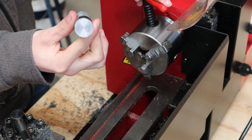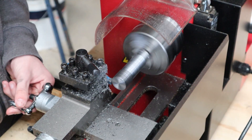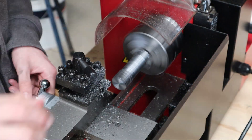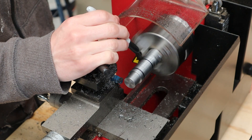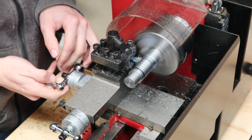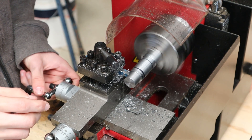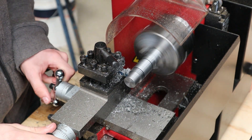I flipped the piece over and took a very light skim coat off the other side just to get rid of the outer layer. I then remarked the scoop locations and gently plunged the tool into them to remove most of the material. The plans call for this to be done with a file, however I kind of like the look of the machined finish. I later switched to a small parting tool for this process, which worked a lot better.